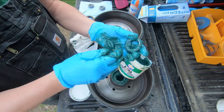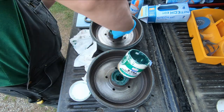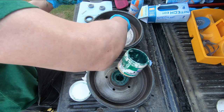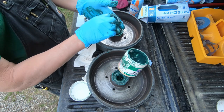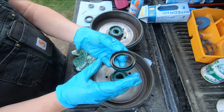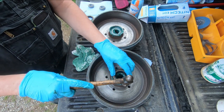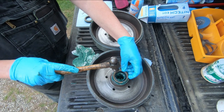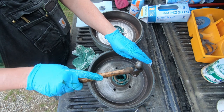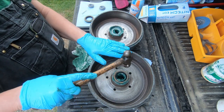I'm all the way around. Now I'll take that grease, put it down in the hole, put a good quantity down inside the hub. That doesn't have to be completely full because you've got a shaft that's going to be in there, but you do want to have a little extra in there. There's that bearing — nice and clean, all greased. Stick it down in there. There's the new seal — lip side down — just go gently with a hammer. It's better to use a big socket to push it down straight, but this will work too if you're careful not to distort it.